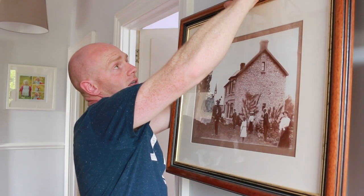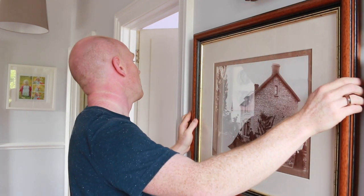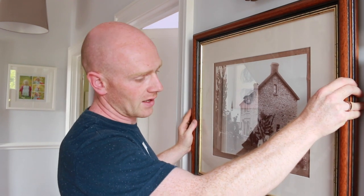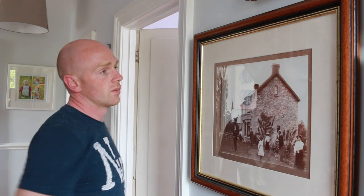My only advice is don't do it on an external wall if you've got solid walls and you're trying to keep things breathable, because plasterboard is not breathable. You'd ideally want to use a lime-based backing plaster, lime hemp, or something like that — and we've done other videos on that. There's one more video from the hall, stairs and landing project which I've got left, talking about sealing paints and a couple of tips we've found as we've been working through the project.